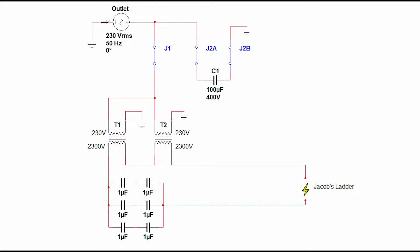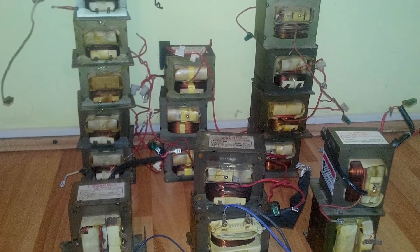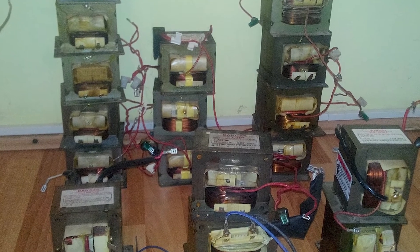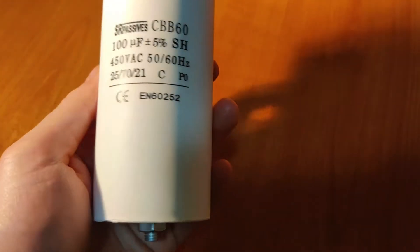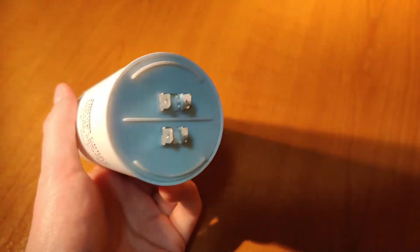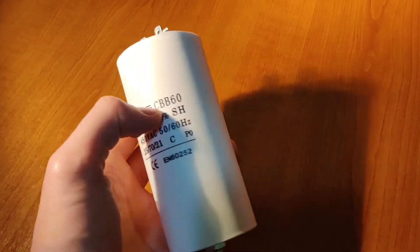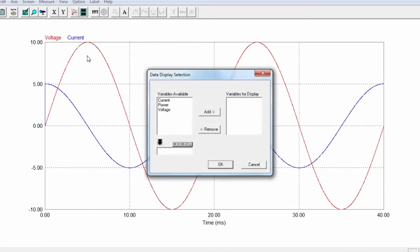Here you can see the full schematic. The power supply is the 230V power outlet. The main switch is used to power the transformers. Then there is a bipolar switch which is used to connect the power factor correction capacitor. The thing with such big transformers is that a lot of current is wasted as reactive power which is needed to magnetize the core. This in turn overloads the grid with additional current which is not used to generate active power. The role of this capacitor is to generate reactive power so it won't have to draw it from the grid. This 100uF capacitor can supply roughly 7A of current which generates reactive power. If you want to know more about this subject, I made a video with an in-depth explanation — link in the description.